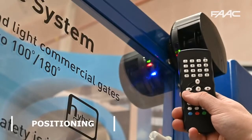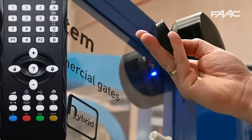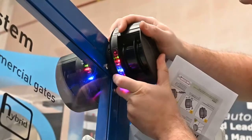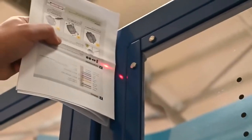The next stage is setting them up. So you unlock the X-guards first, then press one, one twice — that will enable the lasers. These lasers are now used to make sure you've aligned the X-guards correctly, so you will need a little bit of fine tuning. There'll be a laser that will point straight down, and there will also be a laser that will point straight across.